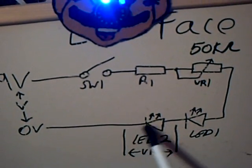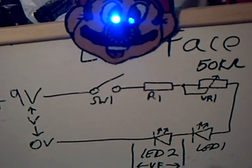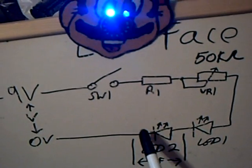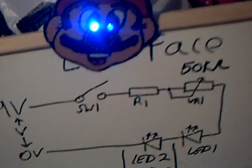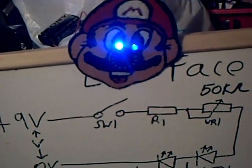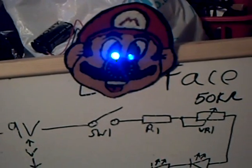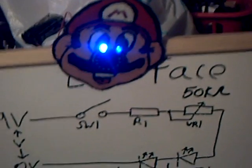We have the two LEDs here in series. If you need help working out R1, just please ask. The LEDs I've used are a couple of high brightness blue LEDs, which I've put in series at about 3V each, so we've got 6V across the two LEDs. I used blue LEDs because Mario's got blue eyes, but depending on what character you do, you could use different color LEDs, or perhaps smaller or bigger ones. You'll need to adjust R1 accordingly, and perhaps the supply voltage as well.